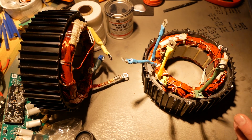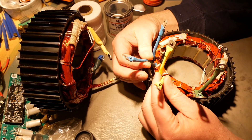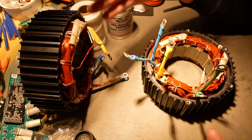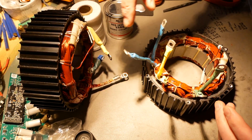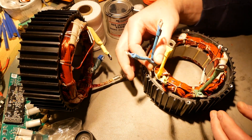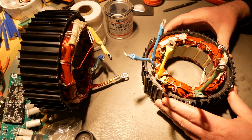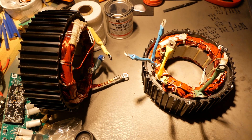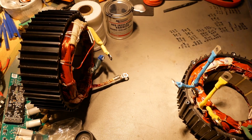I made some predictions which I'll get to. Now that these are all marked — those two are blue, those two are yellow, and those two are green — that's how they were wired together originally, just crimped together under the same ring terminals. The colors tell me which set of wires go together. Initially, I just want to do some performance and efficiency tests, and with two sets of ring terminals they'll still go down to those exact same screw studs.